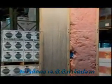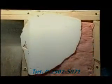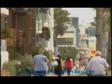We strongly recommend building a training wall at your office so technicians can get a feel for using misting and foaming equipment and see the results at the same time. Determine the number of seconds necessary to treat the void in your training wall using your equipment. Then use that as a guide in the field.